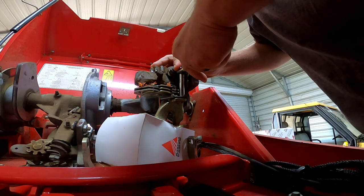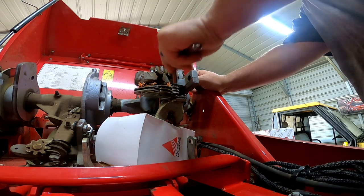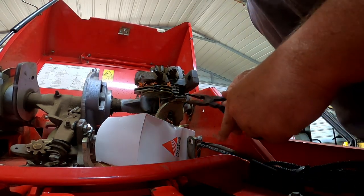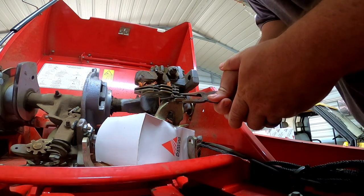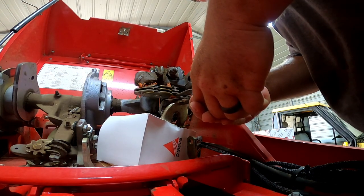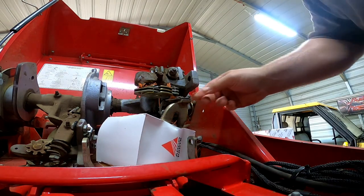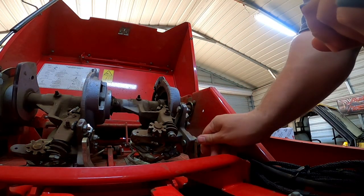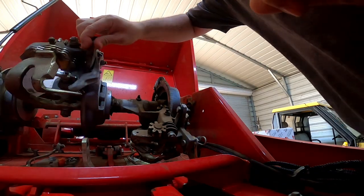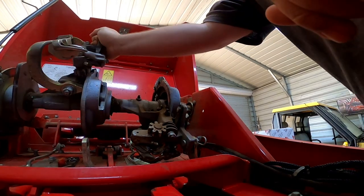I'm going to tighten these — I'll just use this and go along with the impact. I just wanted to use it to run them down. Last thing I want to deal with is broken knife bolts and the knife arm. I check the knife arm against the bill hook to see how much resistance it has — see if it needs more or less. That's about where I want it locked, so that's good.